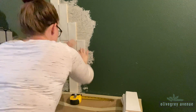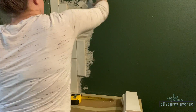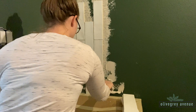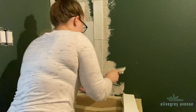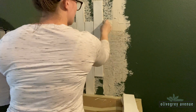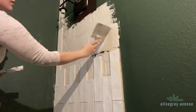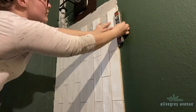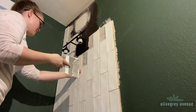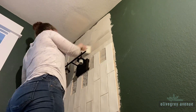This took a little more time because I'm doing an offset subway pattern — I needed to measure the halfway point. I'm planning to place all full tiles before making any cuts. Since I have 12-inch tiles, I measured six inches up from the top of the sink to allow for a half tile I'll cut down. I did this staggered pattern across the top of the vanity and will fill in above my base. Once that first layer was down, it was really easy to continue — all the measuring was done and it went super fast from there.